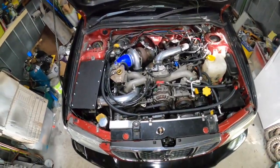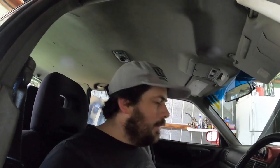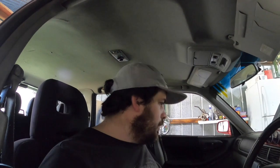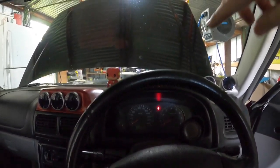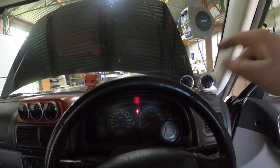She's looking good, boys. Alrighty guys, so just going to start it up, let it warm up in the garage, and then we'll head out. So I'll hook up the Samsung to OBD, have a look on Torque, look at everything there, then I'll verbally say now when I click to log it, so I can track it when I'm editing and see where things are. So I'll have a little play around with that while it's warming up, and see if it sounds any different with the catch can hooked up and the filter on the sump.